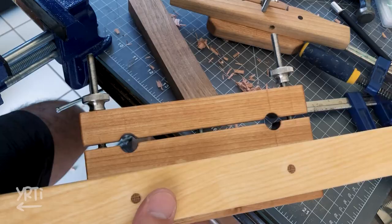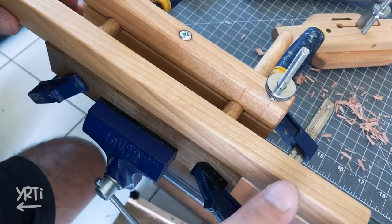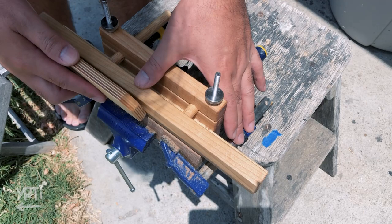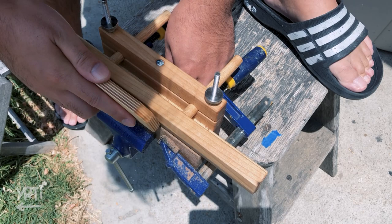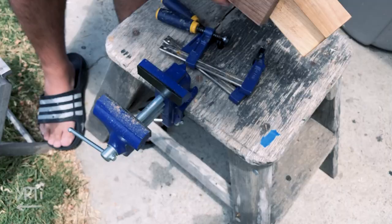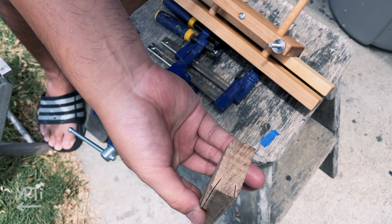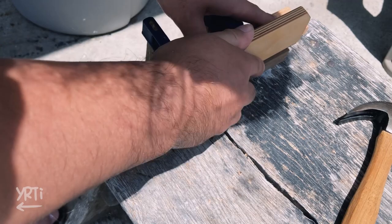Now, the tenon side. I attached the wood to the guide by clamps. I can do it on an end grain for a shelf bolt style, but I'll do it on the edge side at this time. After securing it by a vise and adjusting the location, I actually decided to do it outside, and it ran smoother than I thought. But the thing is, the teeth are so fine that sawdust jumped up in the teeth sometimes, and I had to clean it. But anyhow, I made it. After that, I cut off the shoulders, and here I finished the tenon.